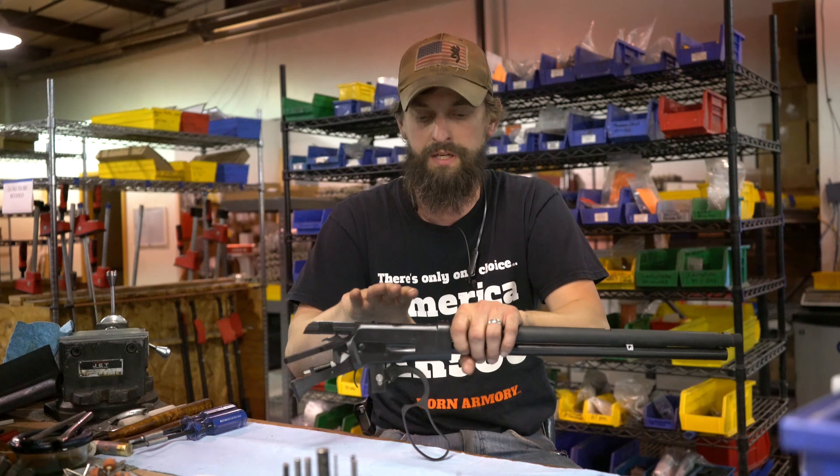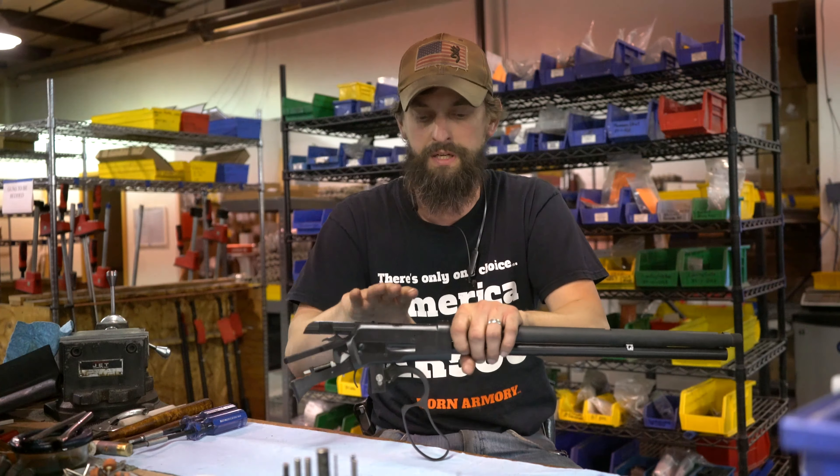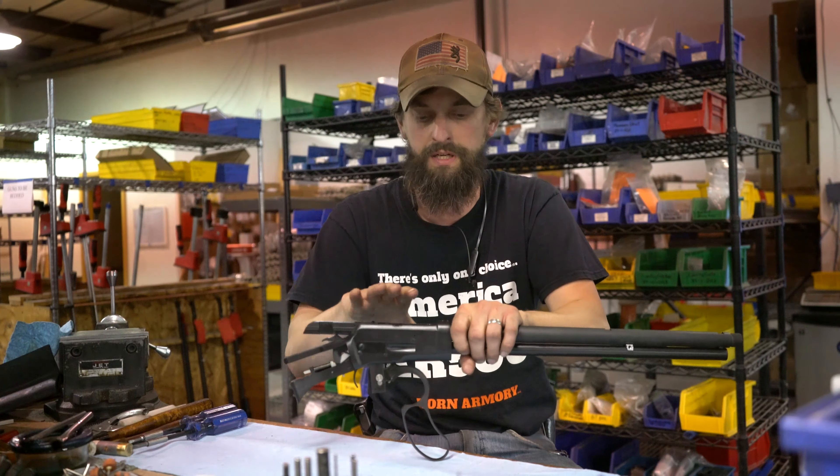The reason ours is called the Model 89 is because it's partway between an 86 and a 92. If you're familiar with those two platforms, you can see the similarities — it has an 86-style gate, and most of our internals just look like really big, oversized Model 92 internals. We've been doing this gun for years. It allows us to do 65,000 PSI and handle it with ease, so there's really not much inside safe specifications that this gun cannot handle. That is where we are today with our 89 receiver, and we will see you at another episode.